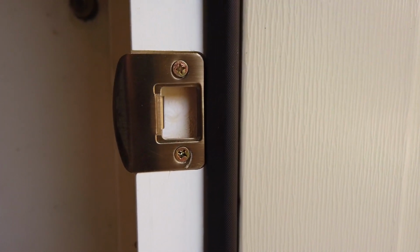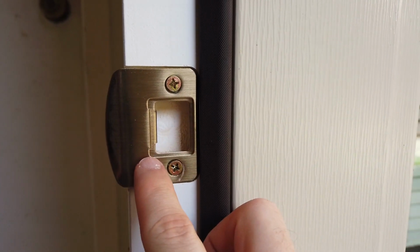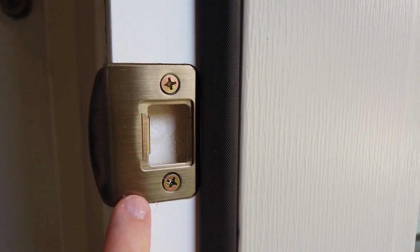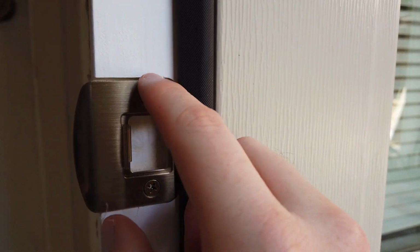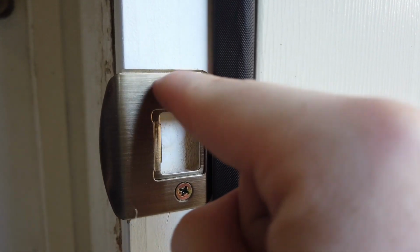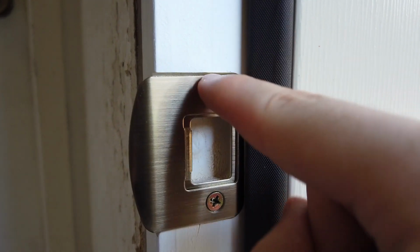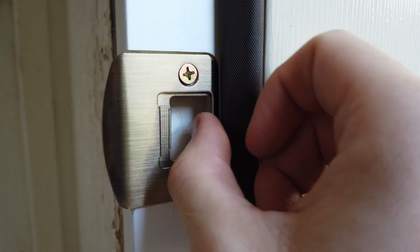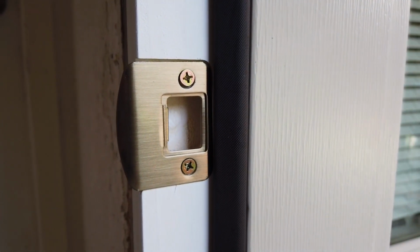And one thing Pete pointed out to me, which I forgot to mention earlier: if you don't have this adjustable strike plate and you need to adjust your door, you can see the door has this mortise here for your strike plate. So with a normal door, where you need to move it because your door doesn't latch anymore, typically you're going to have to take this off and drill new holes into your wood. If you've got all these holes right next to each other, eventually that wood is just all going to get eaten out, and now you've got a screw sticking in there that's not really biting on anything. So with this adjustable strike plate, it's still the original hole. You don't need to drill new holes. You don't need to mess with the mortise. Again, just another great design choice from ProVia.